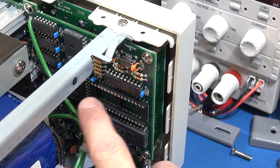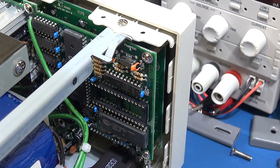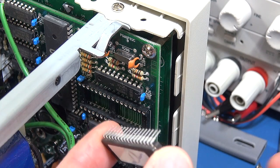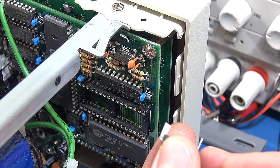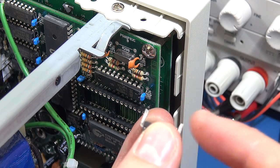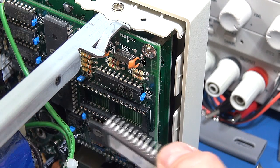There's the same marking on the socket itself. Even if you didn't note the orientation of an IC when you've taken it out, always look on the socket because there is a little nib there which will guide you. I've touched my anti-static strap and touched something else to make sure I'm carrying no static. It's been a long time since I've flipped ICs in and out of electronics — sometimes the legs can be splayed out, so I've carefully checked they're lined up and straight.